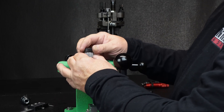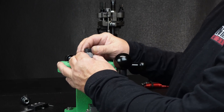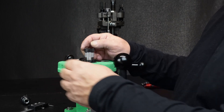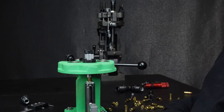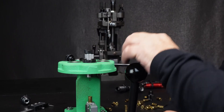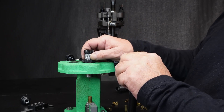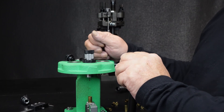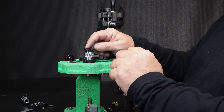Turn it in all the way — you're going to butt up against the o-ring, then back it out a quarter to three-eighths of a turn. Even a half turn is fine but three-eighths is better. You don't want that pin moving left and right. Then take a case and listen for the snap back. That's the spring collapsing, allowing the shaft top to mate with the post. The spring rebounds after that mating is done and the primer is flicked off the pin.